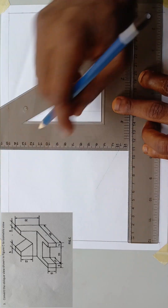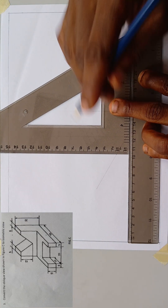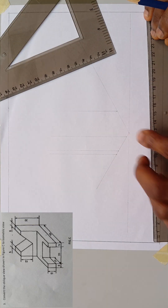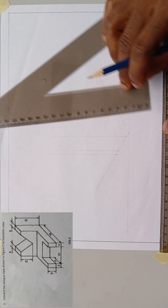For construction, get the H-grade lead — either H, 2H, or 3H as the case may be. For outline, use your H-grade pencil. To project this other end, I'll move down here so that I can see the edge of my set square as I carry out the projection.